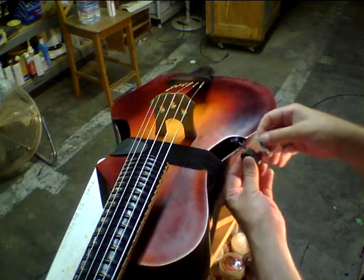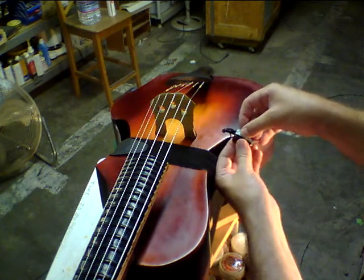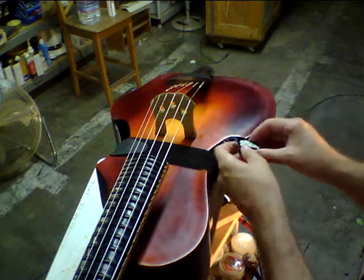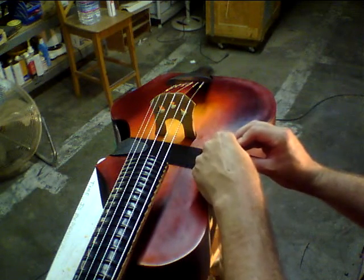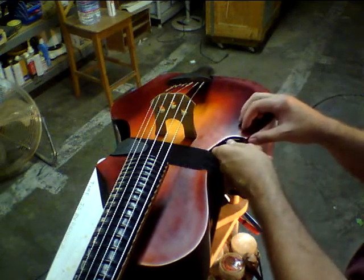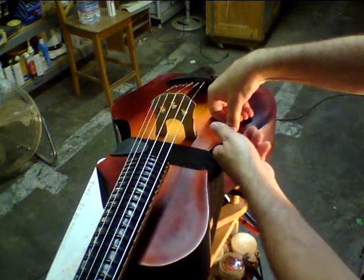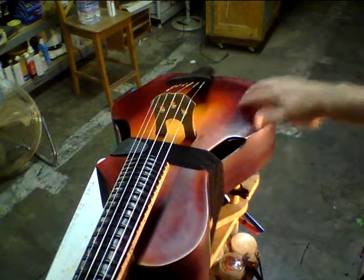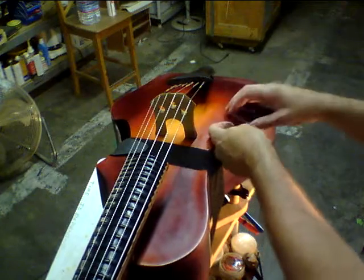So the next thing is to unpackage this little piece with the little green plaid pattern on it. We pick one — we don't need both, these are spares they were kind enough to pack; you might want to keep them around just in case. I'm mounting this double sticky to its corresponding curve on the little flywheel assembly. Now I'll peel this back and expose the actual sticky surface, position it as best we can, then put my thumb on the outside and give it a little push from the inside — but be careful not to be too forceful since the top is fragile.